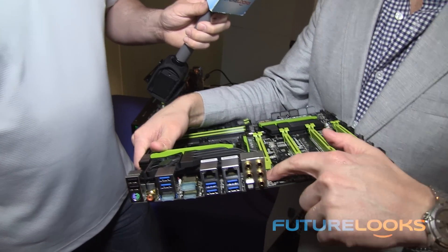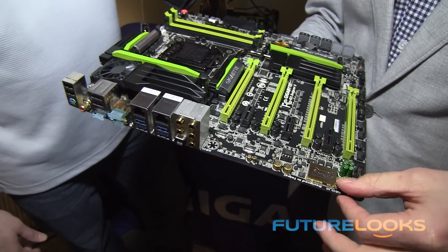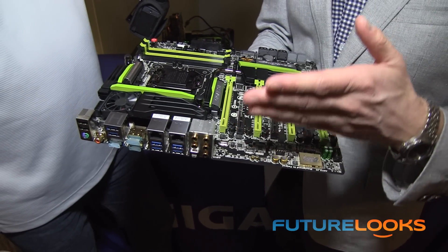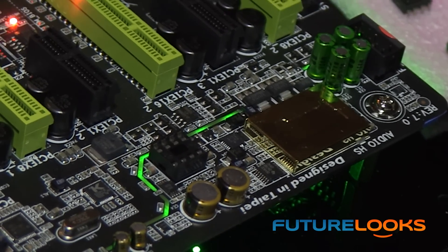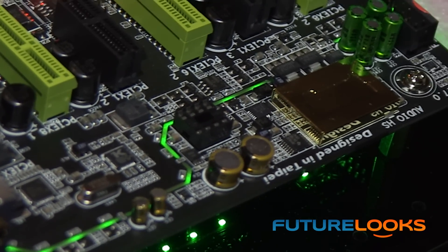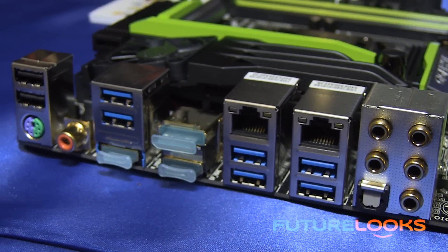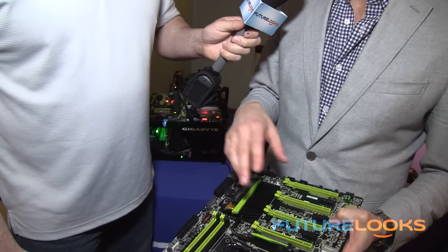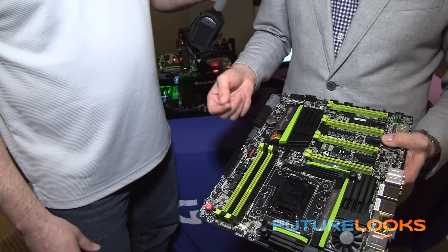This is actually the first time anybody has put this on a motherboard. All of our connectors on the back are gold-plated to prevent corrosion and provide better signal quality. We've also separated the analog from the digital side of the motherboard — audio is the analog side, this side is the digital. We've separated the power layer and ground layer from the motherboard, and you can actually see through the motherboard where we've lit this up with LED lights so you can see the PCB separation. We're still using Killer LAN from Qualcomm Atheros, plus an Intel LAN as well — so dual LAN. And there's Power over PCI Express, so you can use a SATA power cable connector to give power to your graphics card for four-way configurations.